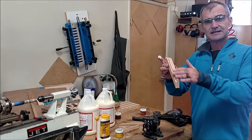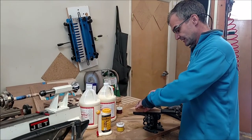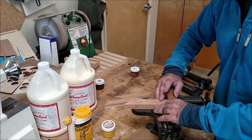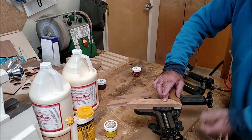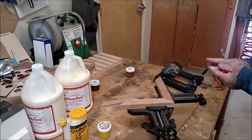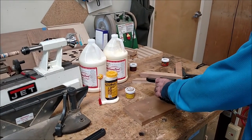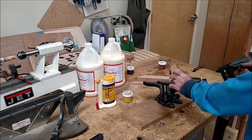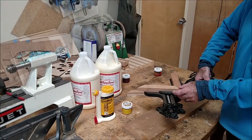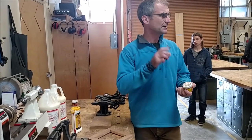My real bond is going to be wood glue, so I get a good glue bond. Before I glue and nail everything together I do any sanding on the inside of the frame first, because I won't be able to get a sander in there afterwards. I use a framing miter clamp, going back and forth — that looks like a pretty good joint. With the nail gun I keep the safety on, never fire towards anybody, always away. I'm only putting one nail in there — the bond is the glue; the nail just holds it. I work my way around and put the frame together.